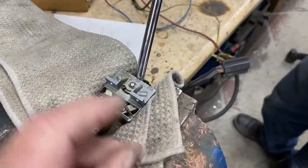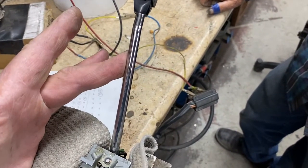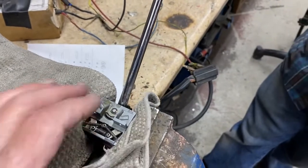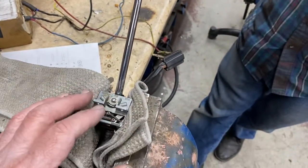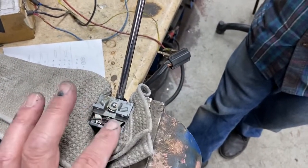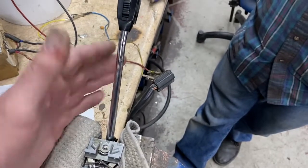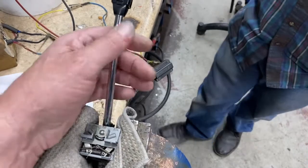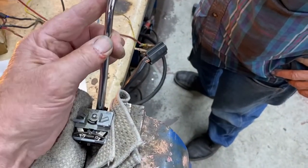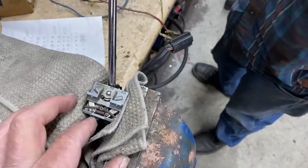We've had to make a compromise in terms of its manual pull-down, which is fairly resistive, versus the trip, which releases it quite easily. There's a metal mechanism in there that we had to file at precise right angles, and the corners of it were rounded and the pins were no longer vertical. They are now because we re-pinned them with a solid axis, and that means that without completely remaking pieces that don't exist, we now have a compromise between holding in place and release by the steering wheel.